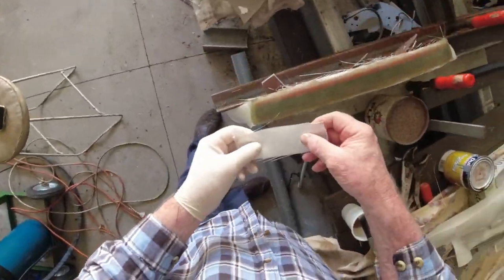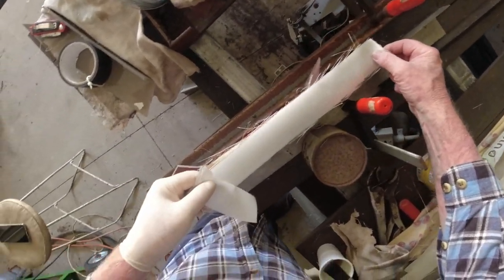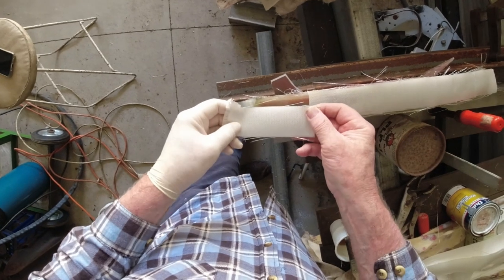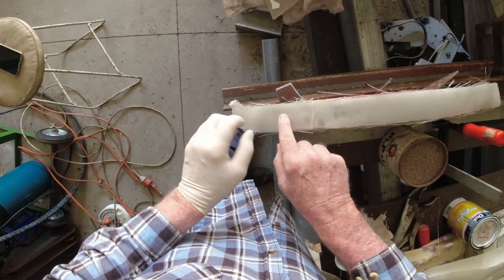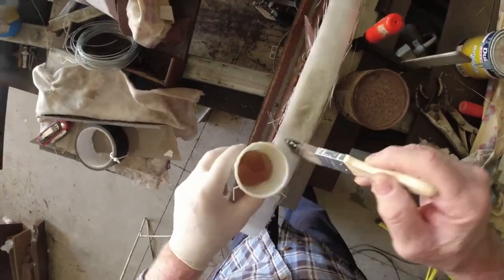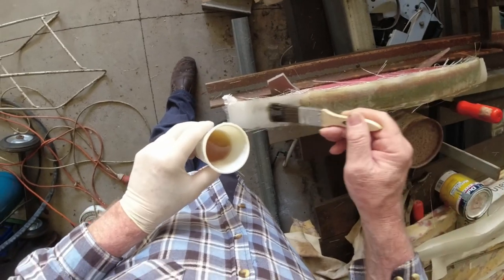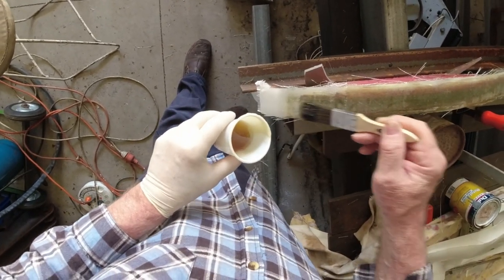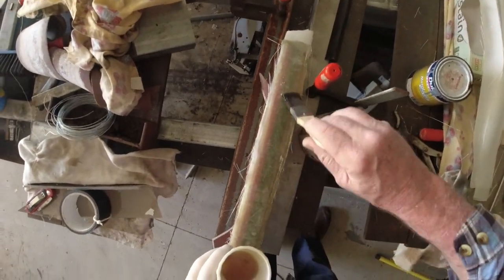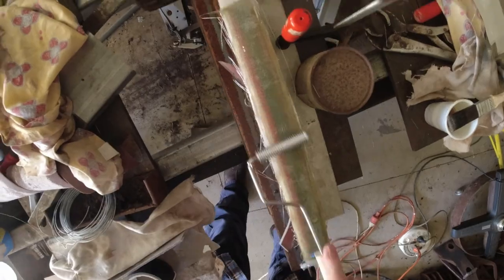This is another thing you can do if you've got short bits. Don't do it on the outside layer, do it on one of the inside layers, and never ever make two joins in the same spot. So if you're going to join another piece, put your join up in another spot. I generally don't like joining if I've got any concerns about the strength of the job. A little bit used judiciously is okay, but don't go overboard and join lots of small pieces.